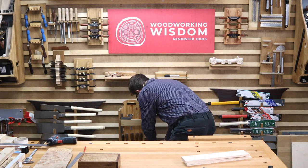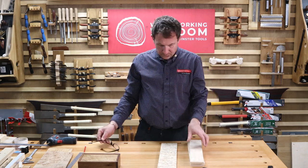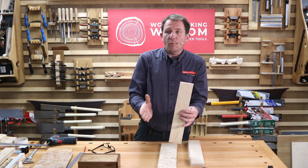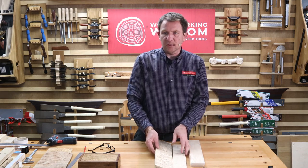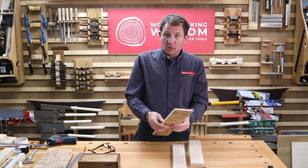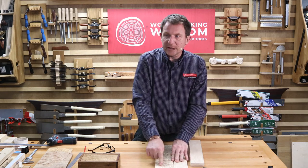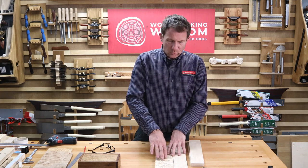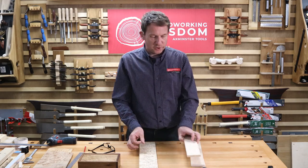I'm just going to grab something that is important, though. When you machine your wood up, watch your thicknesses. Your width, as we said, could be whatever you like. You could make it wider. But for your thickness, you want to try and make it the same as some sheet material. I've got some OSB strand board. When I machined it up, believe it or not, I even put this through the thicknesser, so it's exactly the same height as our ash. That's given us something that's nice and level, which is quite an important part. So when you do the machining for this, machine up some. We're going to see how much you need as we go through.